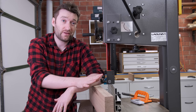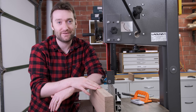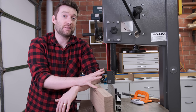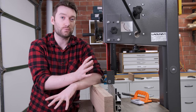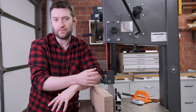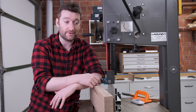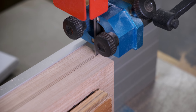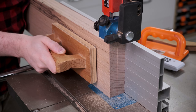There are a couple of additional things that may not be common sense if you're starting out. This is a 14-inch bandsaw and it can handle up to a three-quarter inch or 19mm blade. However on most smaller bandsaws the wheels aren't deep enough to really provide the best support for those thicker blades. I have the most success using a half-inch blade — currently a four or five tooth per inch. I'd ideally want three tooth per inch but it's hard to get that in 12mm. Additionally it's a bi-metal blade; they cost a little bit more but they last a heck of a lot longer.